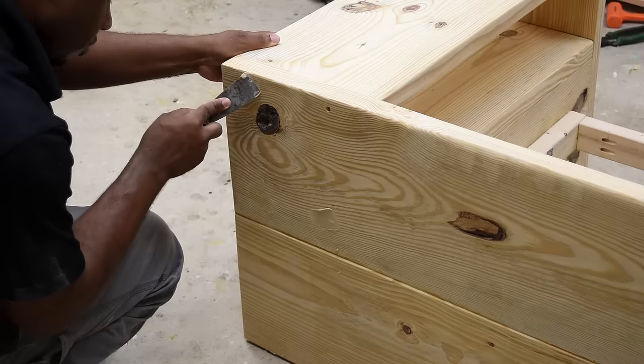To make the slide-out feature work you have to skip every other slat and secure that. It's a bit of a mind game because I'm tempted to secure each one, but I had to keep it together and skip every other one. If you plan to use this a lot, the best thing is to glue and screw these pieces into place because nails can easily be removed by pulling up one of the slats. To attach the 2x4 to the front I put a couple pieces of wood on the floor in the vicinity, clamped everything together as it should be when done, then attached those loose pieces using the nail gun to get an indication of where to sit the 2x4. All I need to do is line up the side to side.